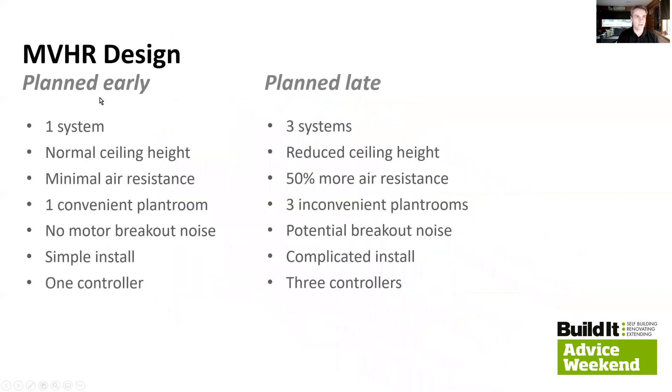With that system in mind, here are the differences had we planned it later. At the moment we've got one system that will ventilate the whole building — it's a large system but it's only one system. Plan B would have been three systems, effectively working out where to retrofit a system on each floor. Originally they were going to have 200 millimetre solid timber joists, but fortunately we managed to talk them into 300 millimetre open-web joists at 600 centres, which means all of the plant is hidden inside the floor void, giving normal ceiling heights. Had we come to the party late, the only way to get the system in would have been to create a suspended ceiling to form a service void. Nobody wants lowered ceiling heights if they can help it.